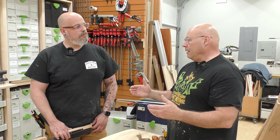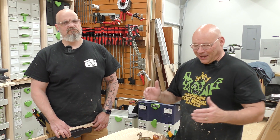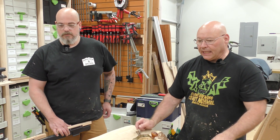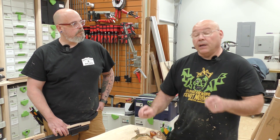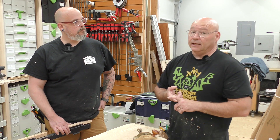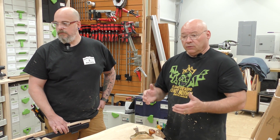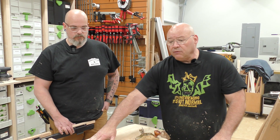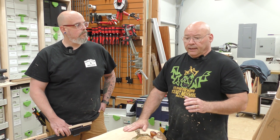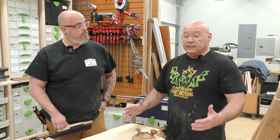As my wife Marianne says, you've got to leave some imperfections in there. We have done a lot of flattening over the last day. What we're going to do is move on to sanding — initial flattening sanding — because we still have to address the natural edge. We'll hit some areas with the Rotex; there's a little more tear out I want to address. Then we'll take a final look.